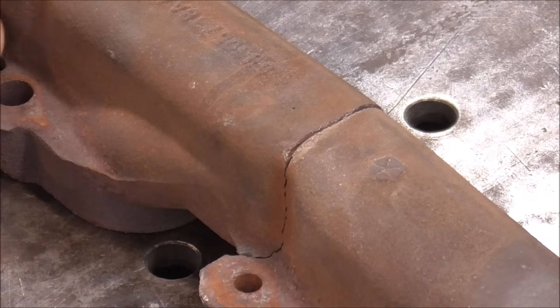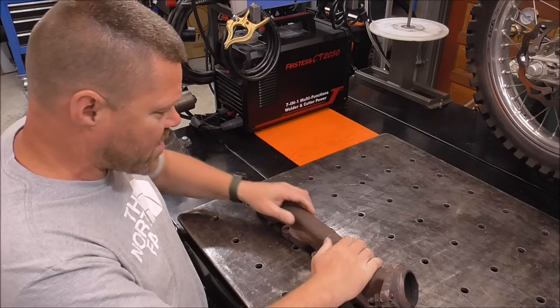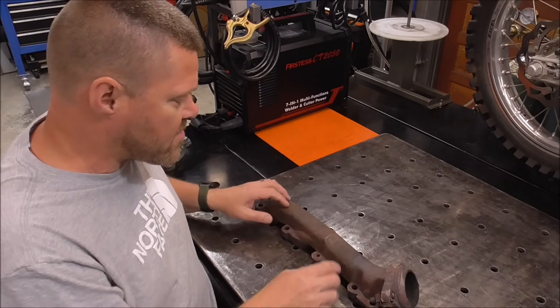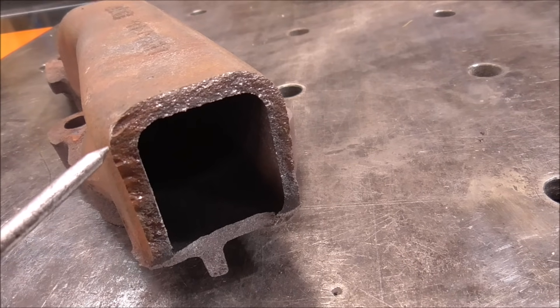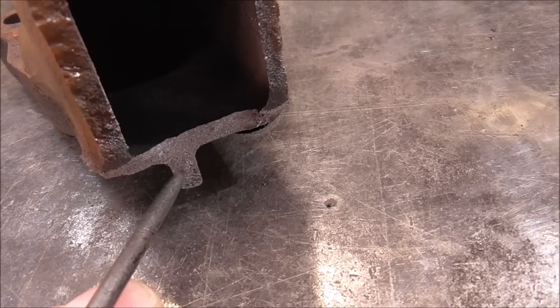This has to last two months — that's it. It's just to get this customer back on the road so their vehicle isn't sitting until the new manifold arrives from Dodge. To make this repair we're going to be using silicon bronze and we're going to be MIG welding it, but there's a lot of steps as opposed to just repairing a crack. I'm going to be doing a preheat as well. I've got to tack this together as it keys together — you can see how it fits a certain way and only goes one way because it fits in tight. If I bevel this all out right now and V it all out to make room for the weld, it's not going to key in as good and the alignment is important because this has to bolt back up to the vehicle. We'll probably have to do it in multiple passes because I've got to get rid of all this burnt cast — you can see how burnt out that is.